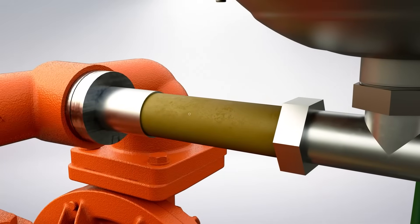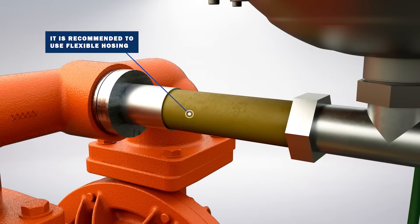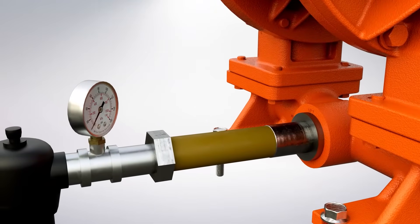It's recommended to use flexible hoses or flexible connections between the pump and rigid piping, as it will assist in minimizing pump vibration. All piping should be supported independently of the pump. Piping should be reinforced, non-collapsible, and capable of high vacuum service.